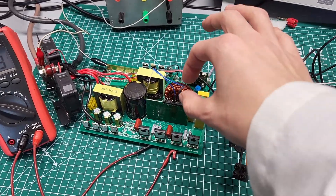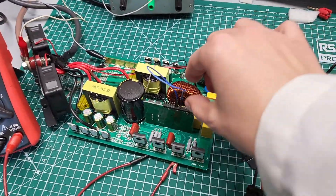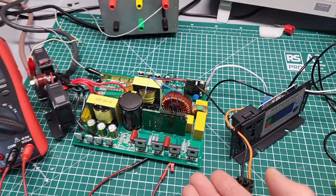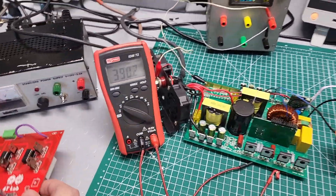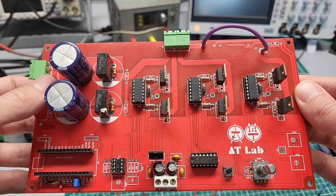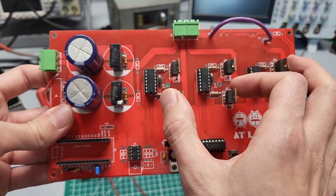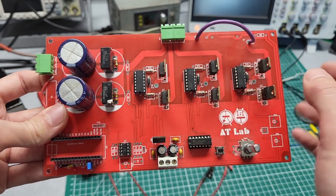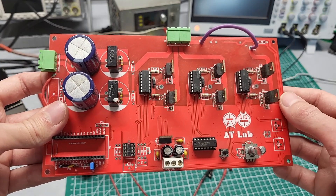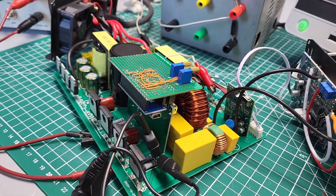After all the time spent on it, at least I managed to fix the DC link — it reaches about 400 volts, and to achieve it I just have to bridge a little connector I added. I can keep the inverter like this because I already have a three-phase inverter that I built myself. I can feed this 400 volt DC link straight into my three-phase inverter and not only get a single phase output by using just two legs, but even a full three-phase output — way better than before. If you're curious about this setup you can find several videos on the ATLab channel regarding the three-phase inverter.